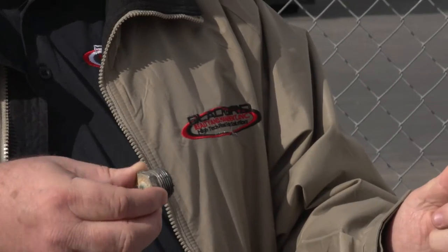How much does it cost to change these rods? You're looking at about an hour labor and a $50 part. So for one-tenth the price of the water heater you could extend its life by one-half? At least — I would say it's going to double the life of the water heater, as well as keep your warranty with the water heater manufacturer.